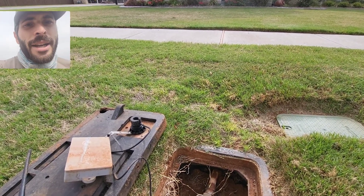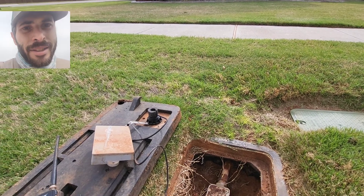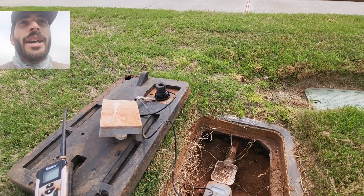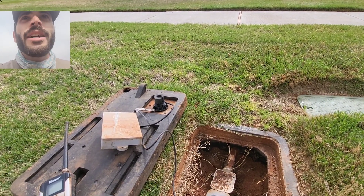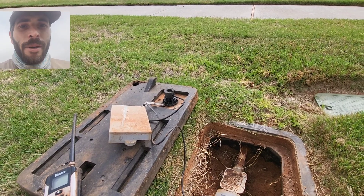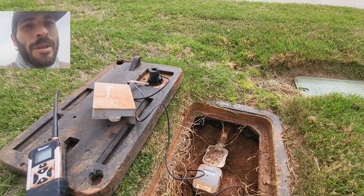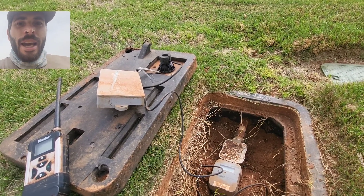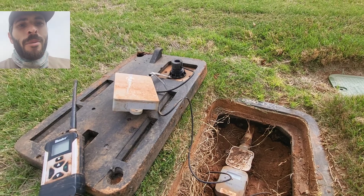Where we are, for that price bracket, you're going to be looking at a little under $8 per 1,000 gallons. So for their system to run the way it is, they're going to be looking at a total sprinkler water bill of around $120 to $130. There's nothing wrong with the system — it's working exactly as it should. If they want their grass to look greener, they're going to need to water the zones for longer, and they'll also need to get a landscaper or someone who knows more about grass to put down the right fertilizer. But this is how you troubleshoot. This is how you give them the information so they can make a decision. Because at the end of the day, it's their water bill. I'm going to give them a recommendation and say, if you do this, it's going to cost this much — but let them make their decision. That way they cannot be unhappy with you.